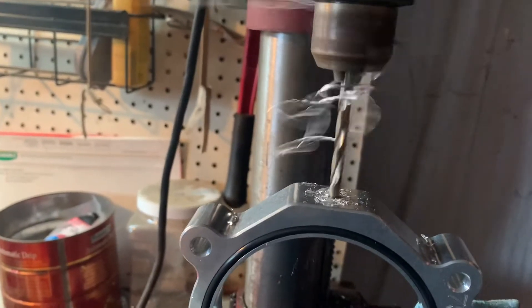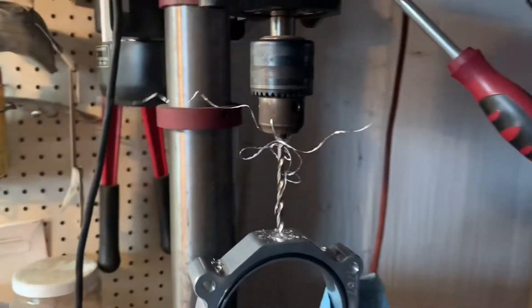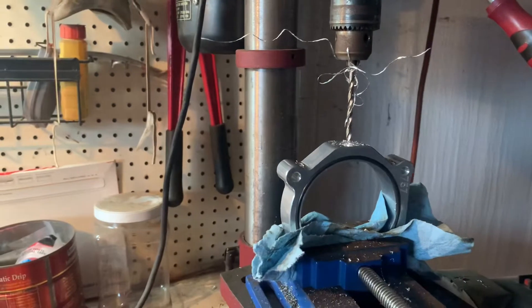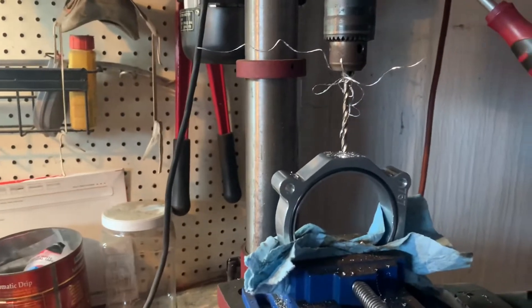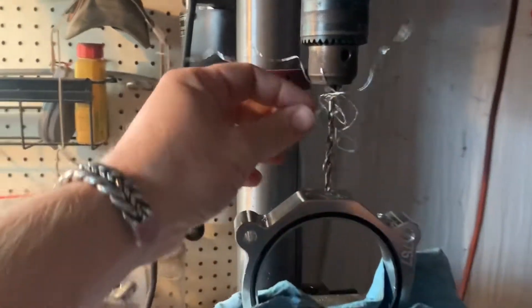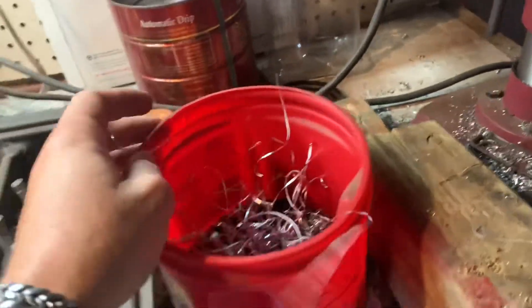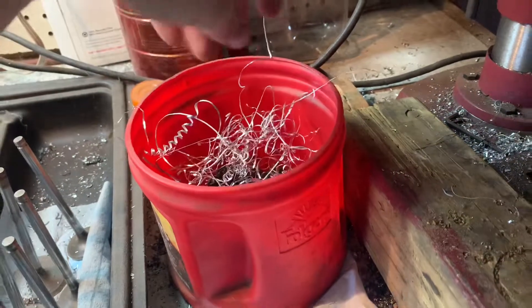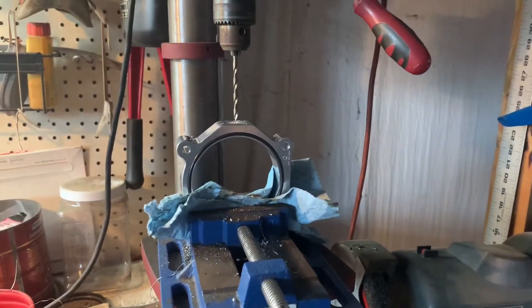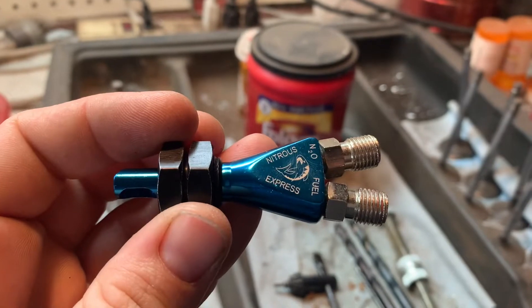Without the vise bolted down, you want noodles coming off like that — that's torque over speed, meaning it's cutting good. When you see people run a drill wide open into metal and it starts squealing and smoking, they don't know what they're doing. You do not want that. You want torque over speed, you want it to cut — this is aluminum so it's softer, but the principle applies to steel too. That's what you want: noodles. It helps your drill bits last a lot longer. Once it starts squeaking, that drill bit's gone.